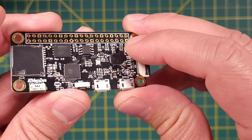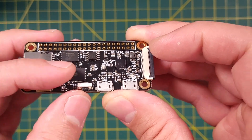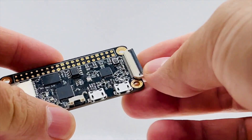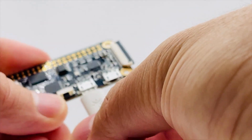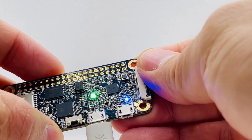Lastly, this new board comes with two push buttons — one for reset and the other to put the board into boot mode. You will need to get familiarized with these two buttons, as you will need them in order to update CircuitPython or to compile Arduino code onto this board.